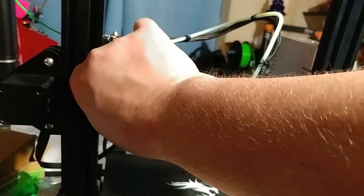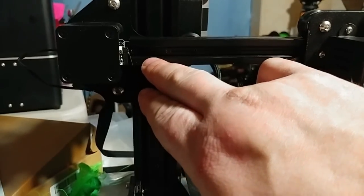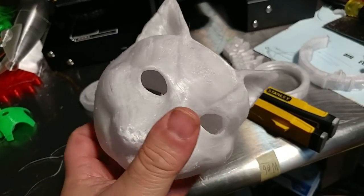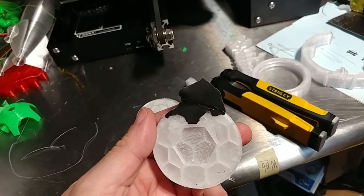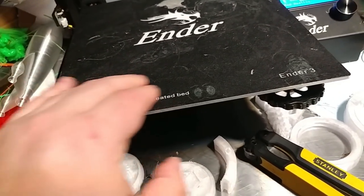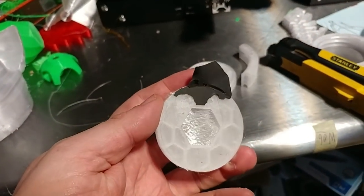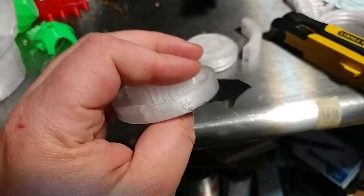I may try drilling a hole through here, but I don't like being so close to the other two bolt holes. I just printed some PETG and it's not bad but I need to adjust. The print surface is a more textured version of what they include on their other printers and it's actually a little too good — PETG ripped a chunk out of it on removal. PETG sticks extremely well — it's the easiest PETG surface I've ever used — but with large surface areas, be careful.